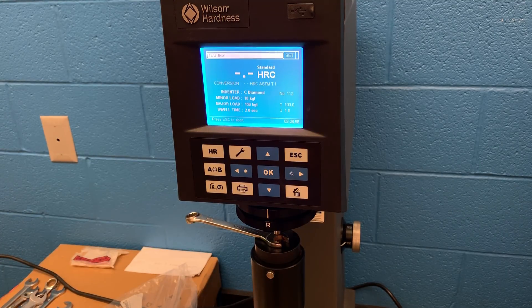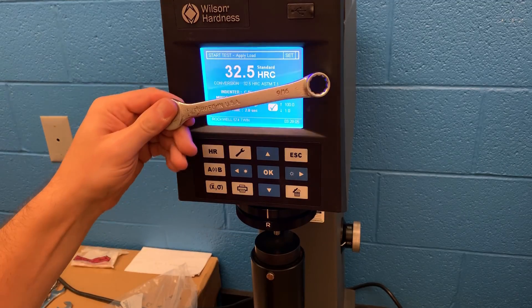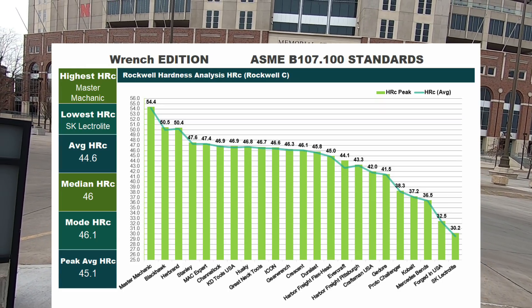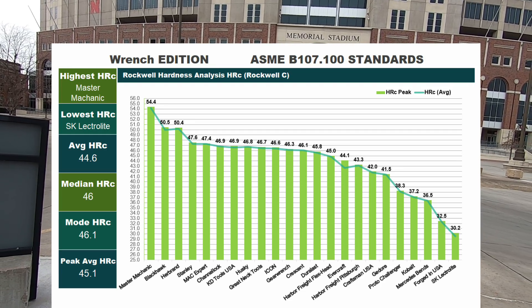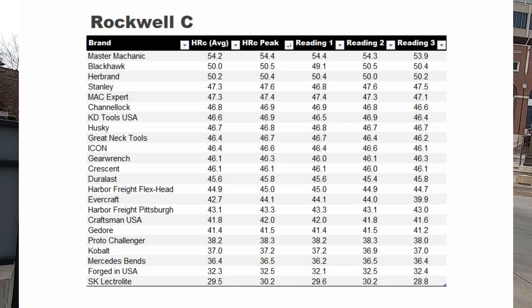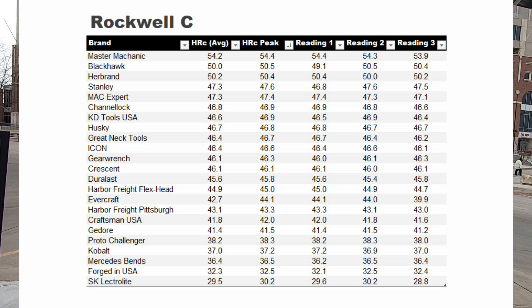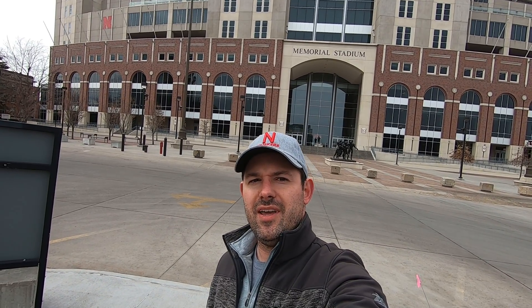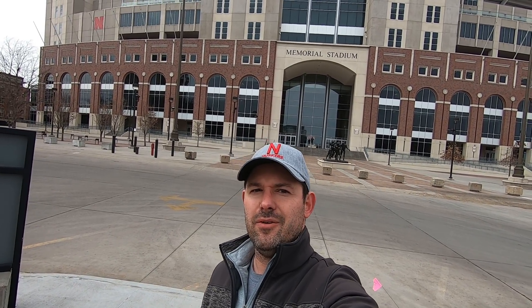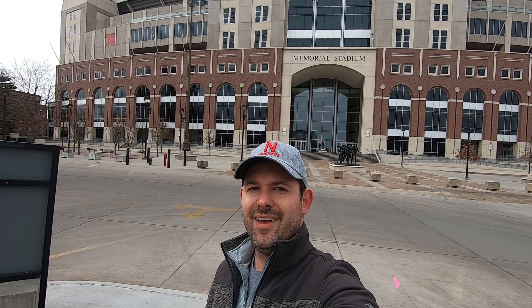Now is the opportunity for you guys to put down in the comments what your favorite wrench brand is and let everybody know what you've had really good success with. That wraps up all the wrenches we're testing today. We got a lot of interesting results looking at the hardness of a bunch of different wrenches. Here you can see a graph showing the highest HRC for all the wrenches as well as the lowest. I did reach out to a couple of manufacturers to understand why some wrenches performed so low — the main responses were that they'd warranty the item, and that on smaller wrenches they don't go through heat treatment because people won't be applying the same forces as with larger wrenches. Really appreciate you all tuning in. If you're not already a subscriber, go ahead and hit that subscribe button. Work smarter, not harder, and I'll catch you in the next video.